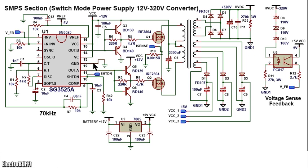Pin 12 is the logic and power ground of the IC. Pin 13 is the voltage supply to the output drivers of the IC. Pull it up to VCC. Pin 15 is connected to a VCC voltage of about 12 volts.